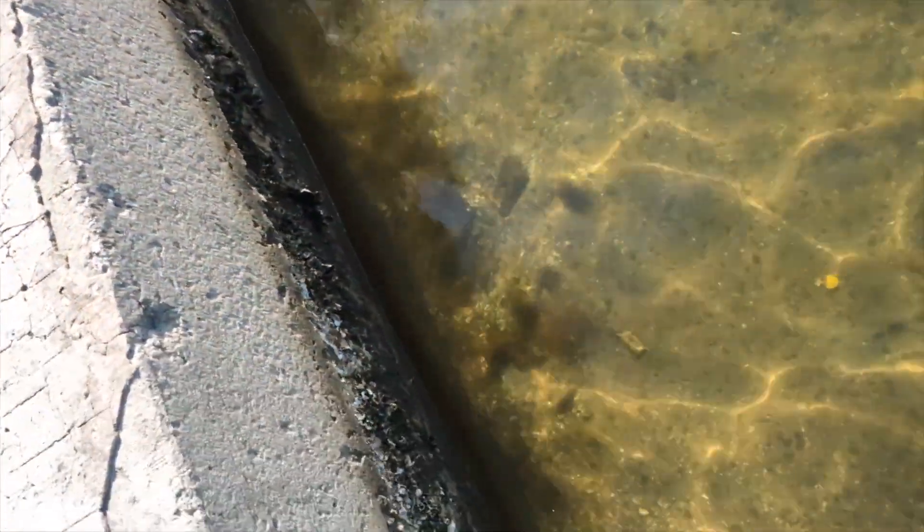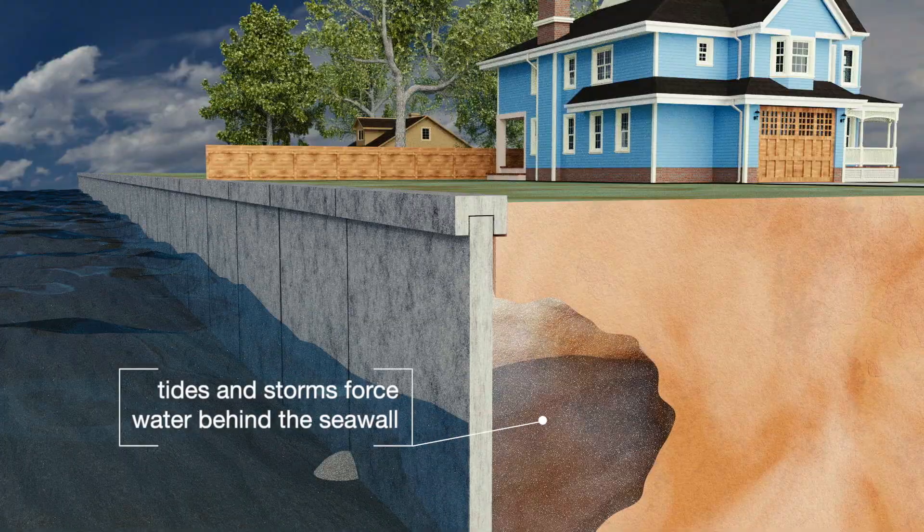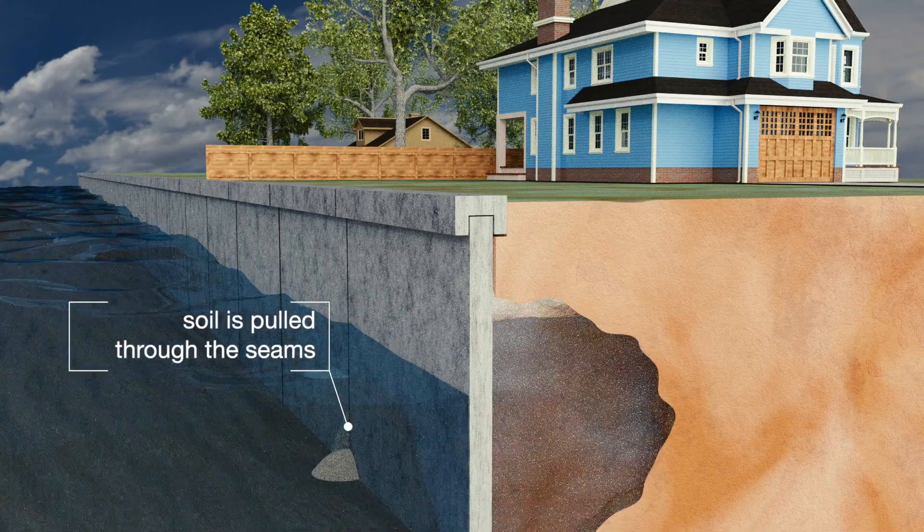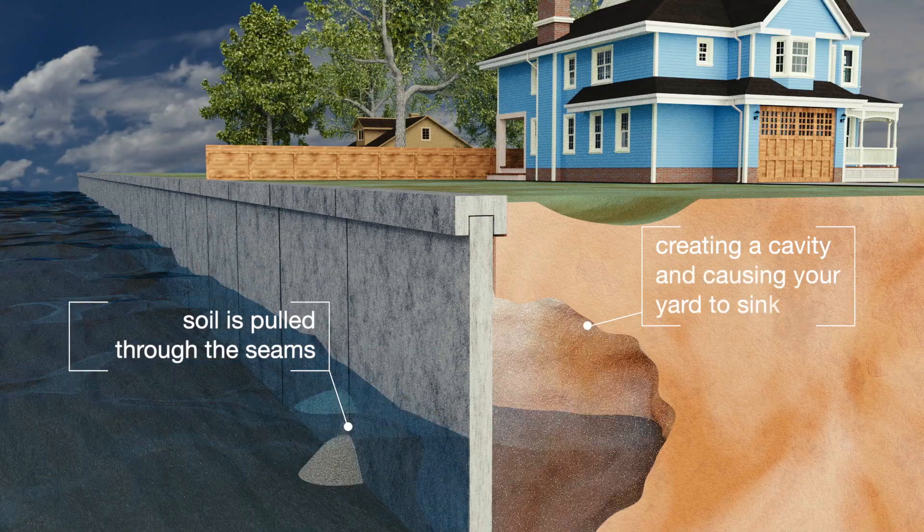Another visual sign: if you look down at the wall in front of it, at the berm or the mud line, you will see actual soil building up in front of the panel seams. It'll kind of look like a pyramid over time.